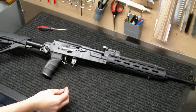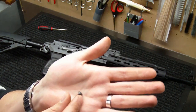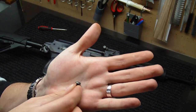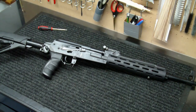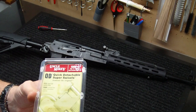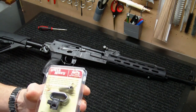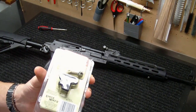So what I did is I took the original mounting screw here, as you can see, and I believe that is a 10-32 screw. I took that out and ordered an Uncle Mike's QD Quick Detach Super Swivel. This is the 1001-2 for 1 inch slings. You can get different sling sizes, but what you want is the machine screw version. The wood screw version isn't going to do you any good.